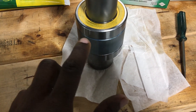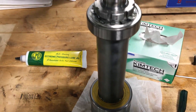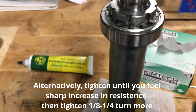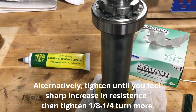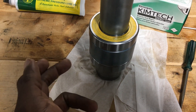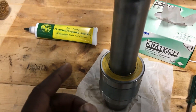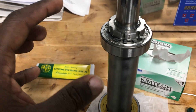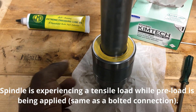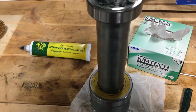I like some lube between the faces — I don't like metal surfaces touching each other with nothing there. To control preload, you can look at how many threads you had exposed on your spindle — that should give you roughly the same amount of preload as before. The shoulder of the spindle seats this bearing, the lower portion of the pair of DB duplex bearings, and the nut applies a compression load onto the whole assembly, compressing it and putting the preload on the assembly.